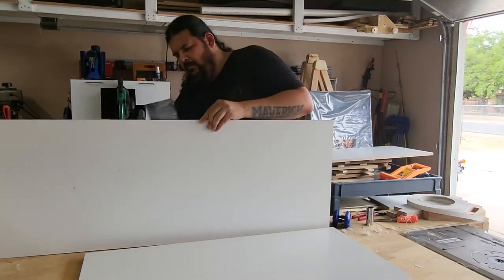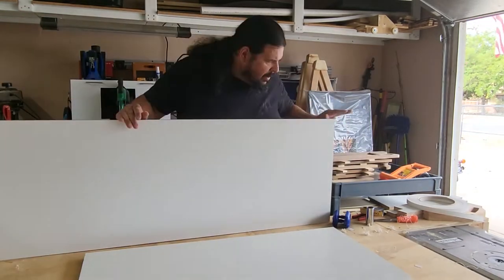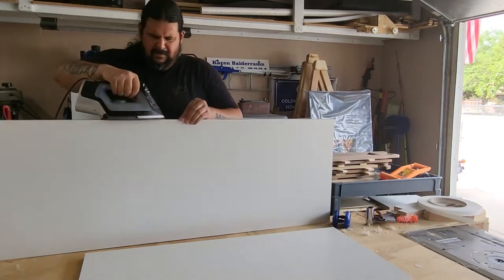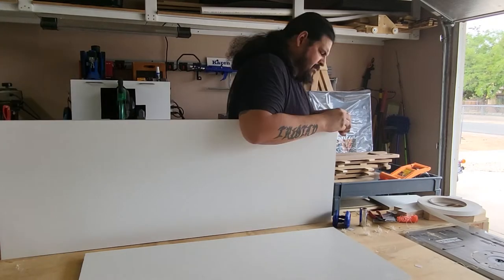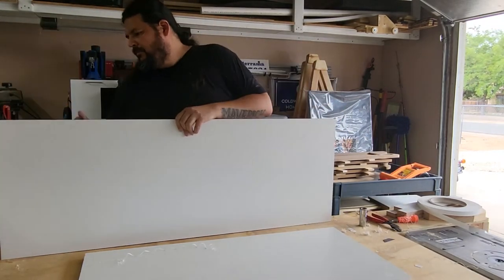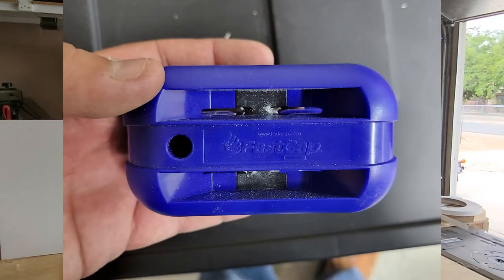Once it's on, you'll need to trim off that 1/16 excess material. Now, this can be done a number of ways, one of which is to simply do it by hand with a razor blade, or you can buy a special tool for it. The razor blade method works, but it does take some practice and a steady hand, which I did end up getting decent at doing, but I opted to go the special tool route and bought this Fastcap quad trimmer